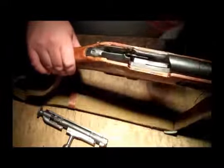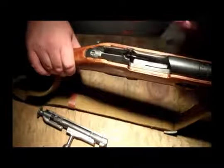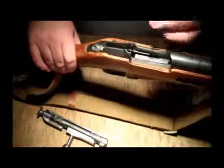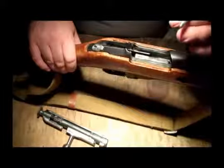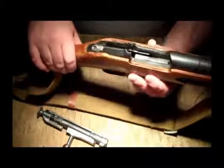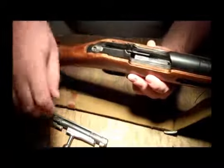That may be due to a shimming job, a filing job, or a loose screw in there holding the sear. A lot of the time those things come loose. That's really the only thing that can cause it.